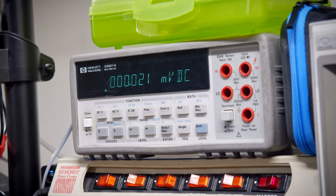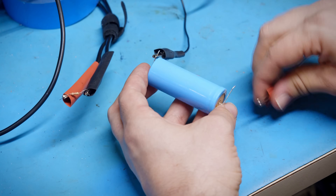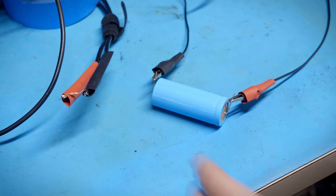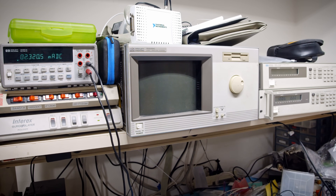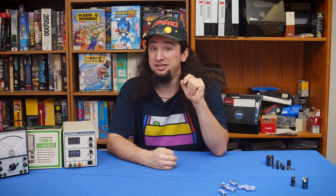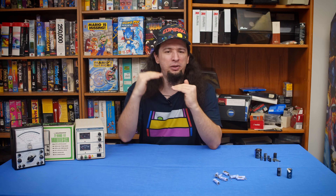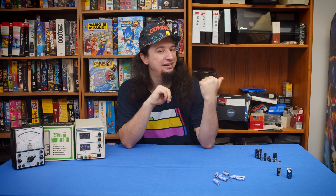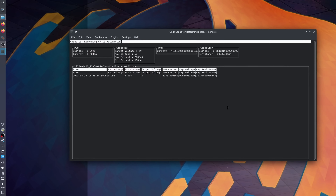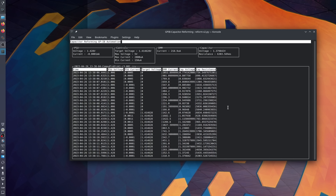I've been building up a lot of stuff with this use case in mind specifically. Primarily, I'm using an HP 34401A DMM and an HP 6633A power supply for this. I'm connecting the DMM for current measurements after the capacitor and resistor. I can use the button panel on the power supply to directly set the voltage I want and read out the current clearly. But there's another reason I use this hardware — it has GPIB, which makes it computer controllable. The process we're doing here is not all that complicated: if the current is below A, raise the voltage to B using Ohm's law, resistor value C, and maximum current D. So I wrote some software to automate this.